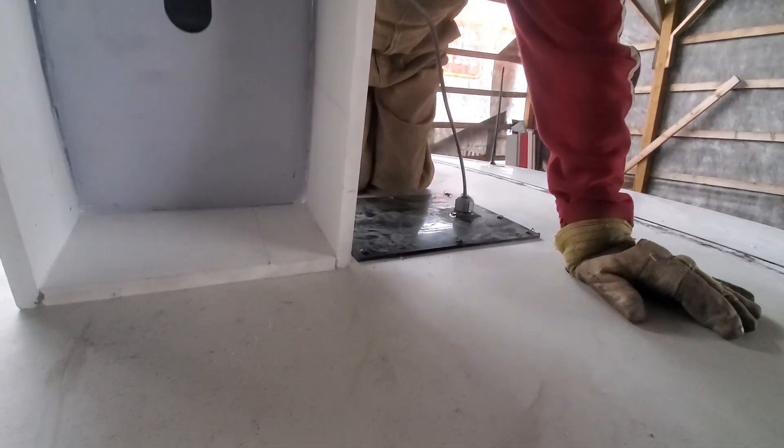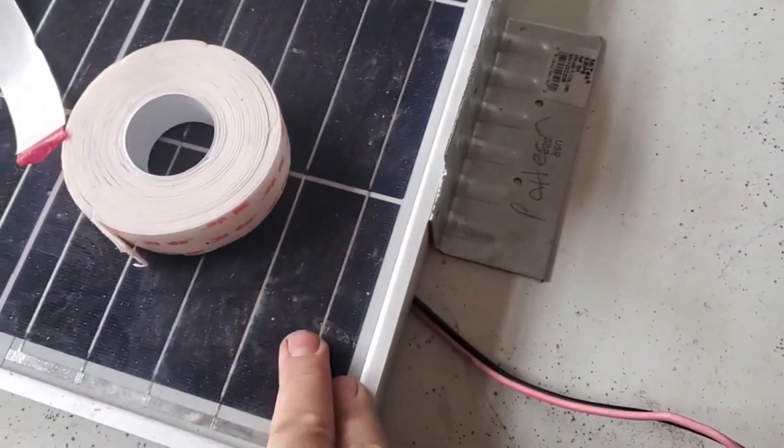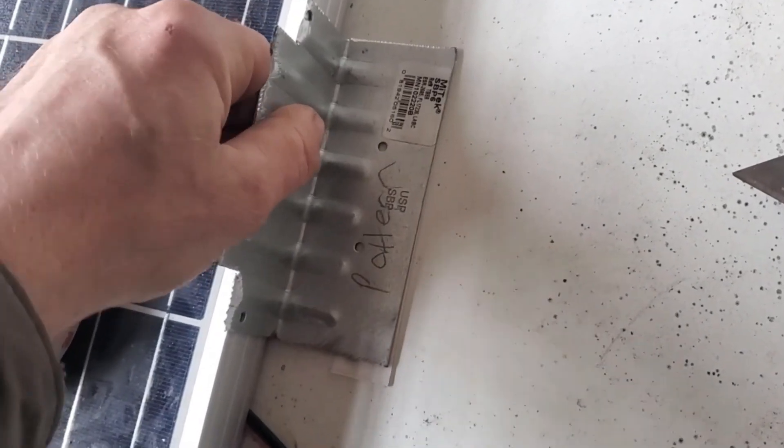To be honest, I did a lot of research and double-sided VHB tape is supposed to work really well for mounting solar panel brackets on the roof. I have to admit I was a little skeptical — it's just tape. But I just stuck my first bracket down and I am pulling on it as hard as I can. I had to pull pretty hard to get it off. They use this tape to hold windows in skyscrapers, so it's incredibly strong, and it sticks even better when warm.